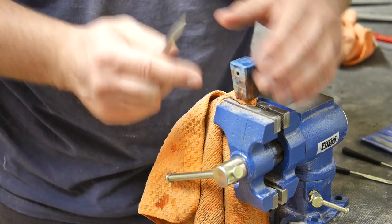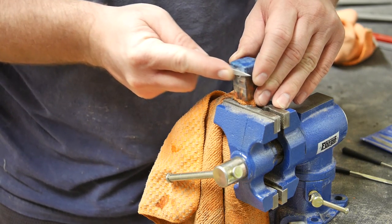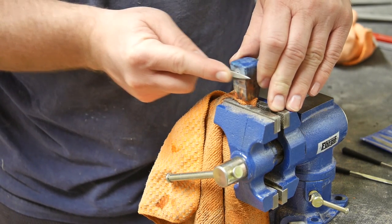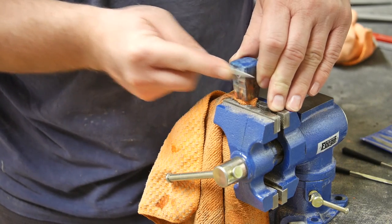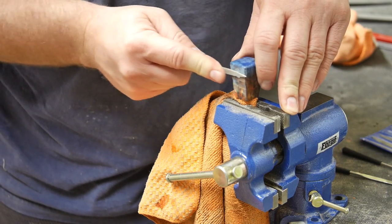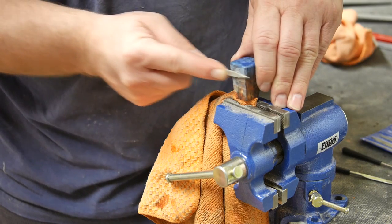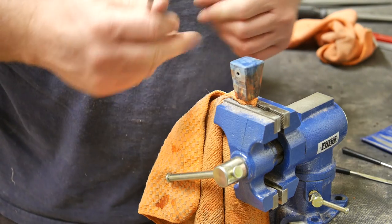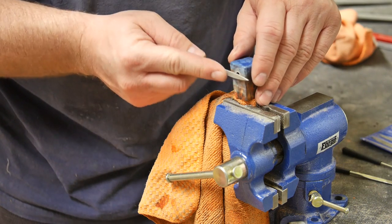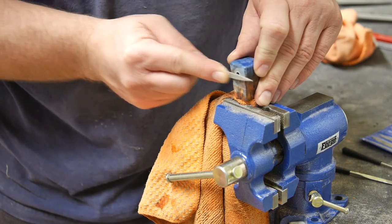I can make very fine contour shapes or passes with this in very small movements. And the diamond coating is also a much, much finer surface than the standard file. So it leaves smaller and finer scratches in the steel, which makes transitioning up through the grits of sandpaper a lot easier without leaving really deep, hard scratches that just take forever to get out with sandpaper. So this will do a good job of blending it